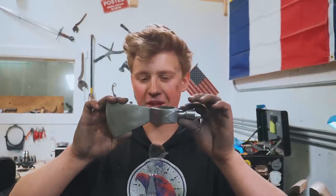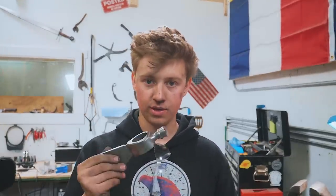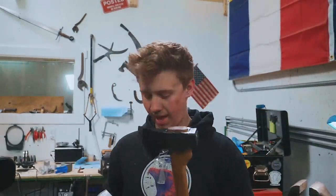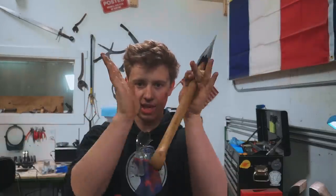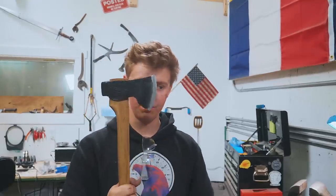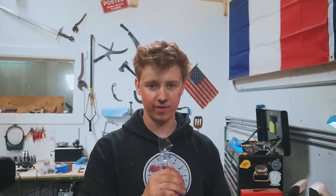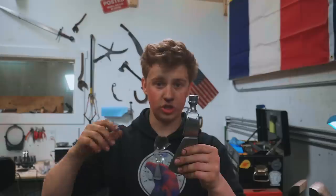You've seen it in slow motion flyby shots. The head's pretty much done, ready for etch. Time to move on to the handle work — cutting out a piece of hickory and fitting it to this eye. I'm making this handle and it's going to take a lot less time than if I was fitting it up on an axe. The reason for that is that a tomahawk eye is not an hourglass shape like a hatchet or a hammer. A tomahawk eye just tapers in one direction, and so the handle is only held on by friction and not by a wedge of any sort. Basically the handle will be made to fit and pushed through, and then it will flare out at the top and be held on just by friction.